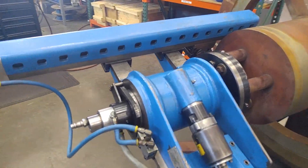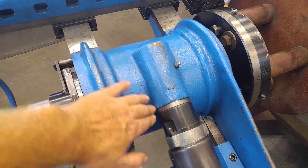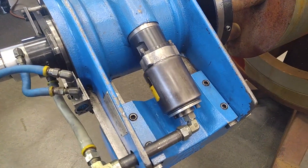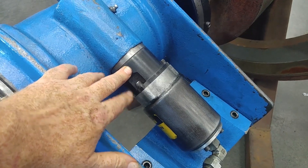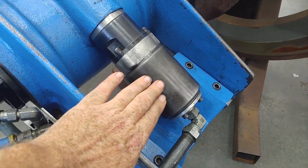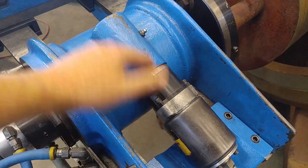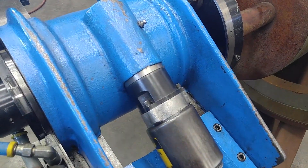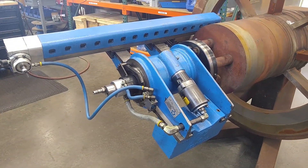The drive on the machine is pretty robust. It's got two very large tapered roller bearings in the housing along with a large diameter brass worm gear driven by a steel worm. While this is really heavy duty, the weak point is going to be on the Ingersoll air motor. Inside the planetary housing there are some very small gears and pins along with small bearings and phenolic vanes. Most often the only maintenance point on these motors is the vanes — take the motor off, replace those five vanes, and they're going again. From time to time, because of the hammering going over a welded surface, the planetary housings can fail eventually too. But the machine is really strong and robust, and because of that worm drive system, even the motor lasts a long time.